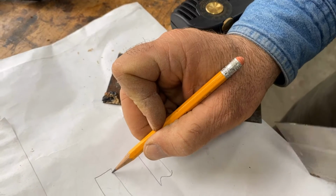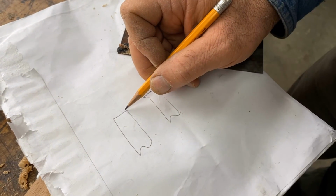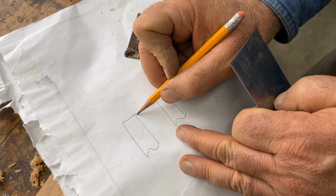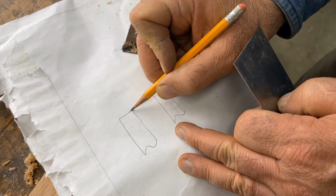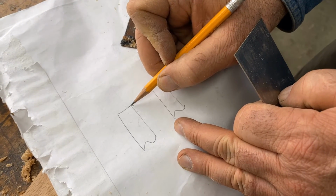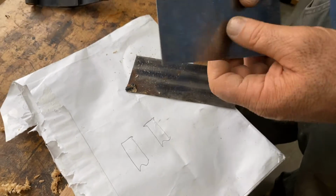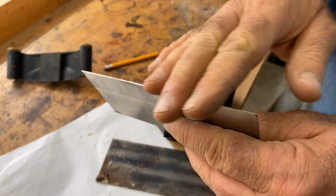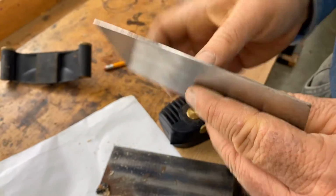So it starts off like this, and then we apply some pressure, and we slide this over a piece of hardened steel, and it turns a hook. It makes a hook by bending the metal down. It's very, very small, of course. It's, as I said, almost microscopic. There are hand tools you can use, sort of hardened steel, that will cause the hook to be drawn.